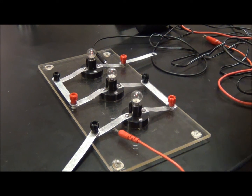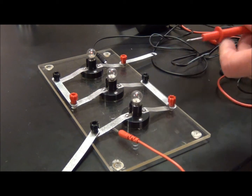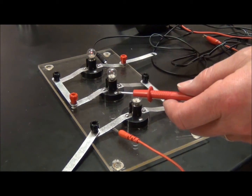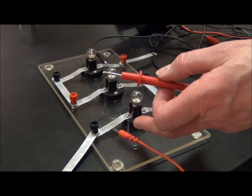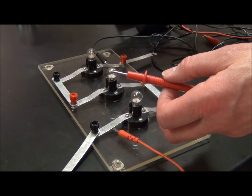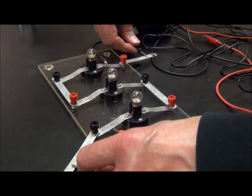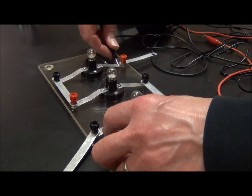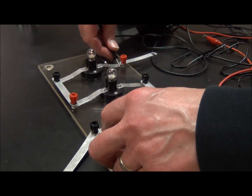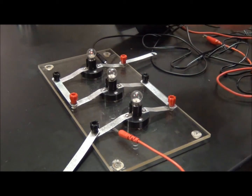To obtain the total voltage for a series circuit with resistors 1, 2, and 3, place the probe near the positive end of the power supply. Place the negative probe of the voltmeter near the negative probe of the power supply. You can experiment with placing the probes out here, or moving them inward, or placing them at other positions, to see if it makes a difference. But this will be your total voltage for a series circuit.